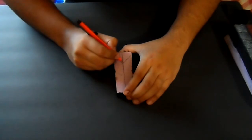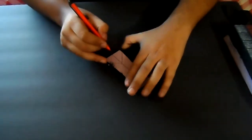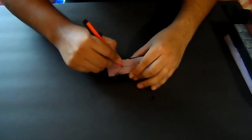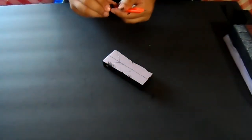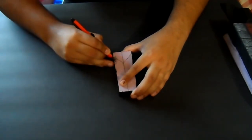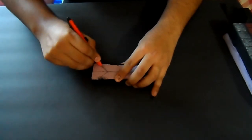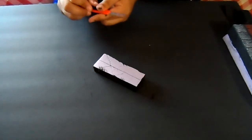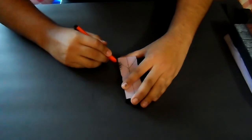So as you remember, I'm just going to take my blade and go ahead and score the lines that I drew once. And then I'm going to extend my blade and make another pass on those same lines down. And then same thing on this side. And then the third time, I'm gonna extend my blade a little bit more and then cut off the piece completely straight off.